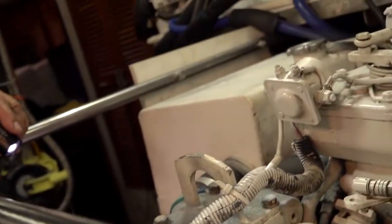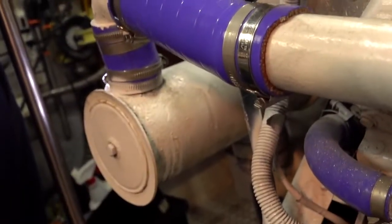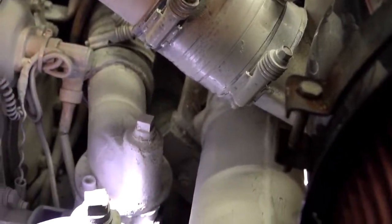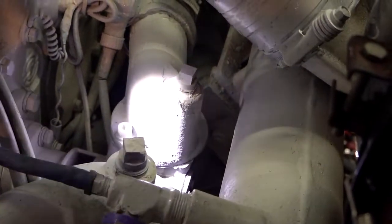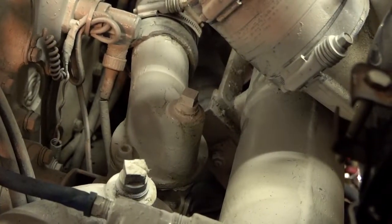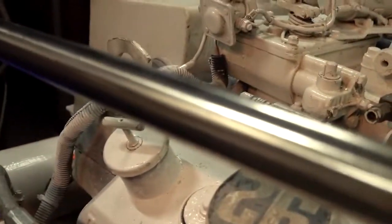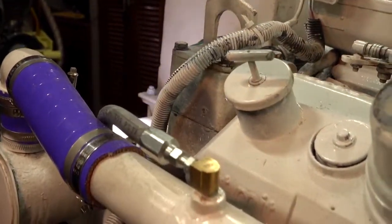This is your heat exchanger — there's a zinc in here. The zinc back here we're not going to use because when the pumps were opened up, the zincs were stuck in the raw water pump, so these just have plugs on them; pieces of zinc can fall down into the impeller. Where you do have the zincs is in the output zone — the inlet and outlet. There are two places for zincs: here and the other end, and that's the only two places you need them.